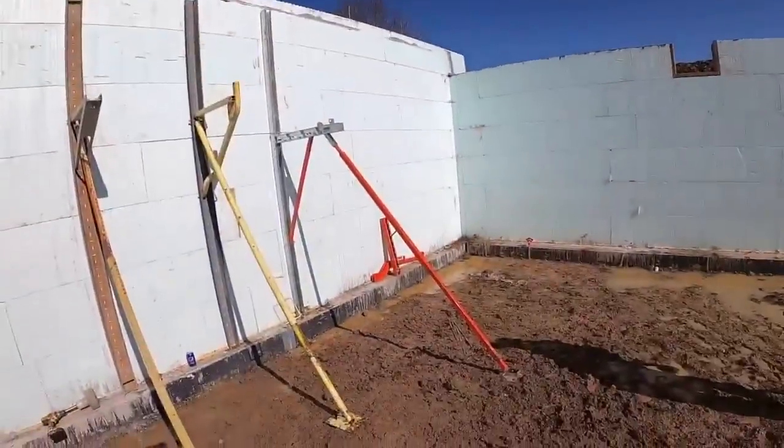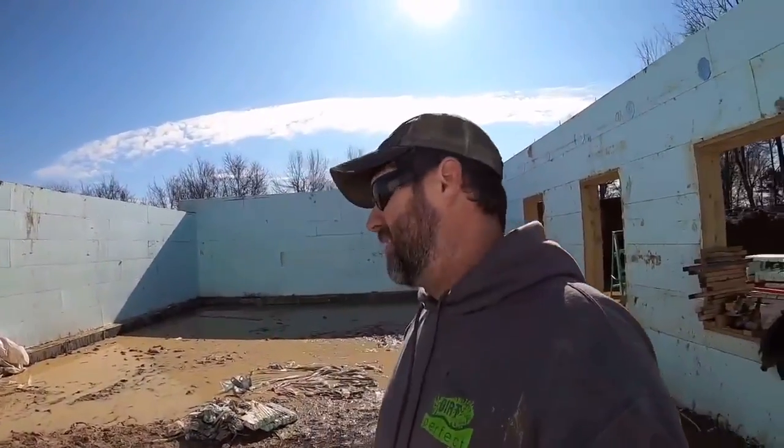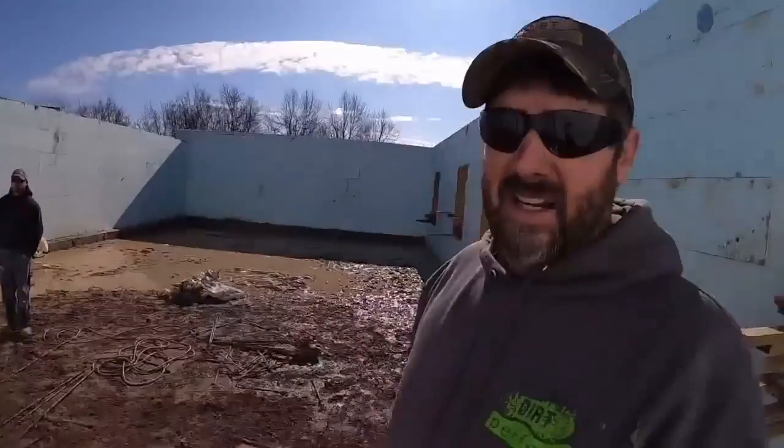Hopefully that answers a lot of questions on the ICF bracing. I know we don't do a lot of it here on the channel, but that's all we did for about 7 to 10 years was pour ICF. So we've got a little bit of experience behind us. Like I said in the previous video, if you're going to do much ICF, you've got to have a good bracing system. It makes pour day and the quality of your work so much better.